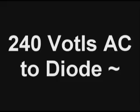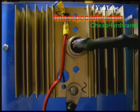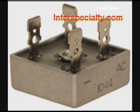240 volts goes to the AC input of your diode bridge, and it's marked with a squiggly even on your epoxy pack, or it may actually say AC. Yours will look more like this — either a metal or entirely an epoxy pack that should be attached to a heat sink. It's got spade connections for easy plug-on connectors, so you don't have to solder those. Just crimp it on.